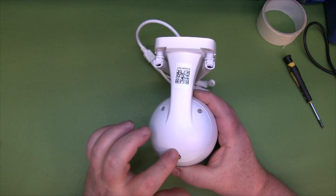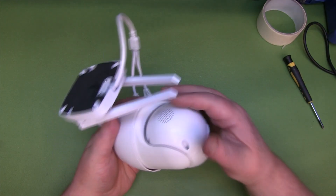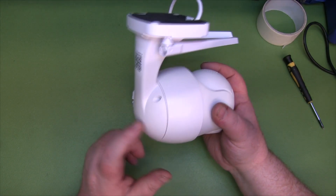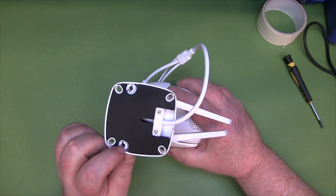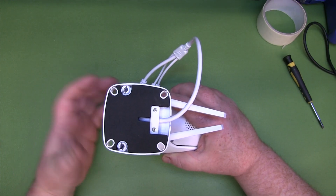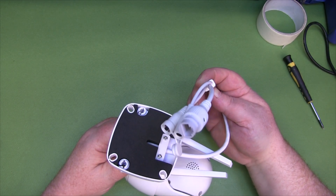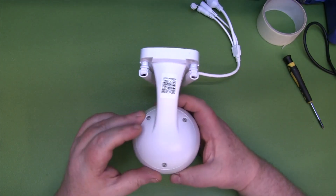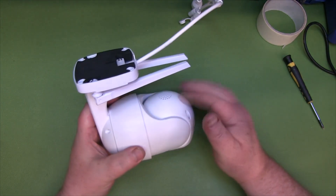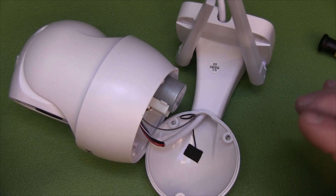The main construction is straightforward — there are three Phillips screws holding the back plate on and four Phillips screws holding the ball of the main camera together. The circuit board will be in the main section; there are probably gears in another part. We've got two antennas with black coax and grey coax going in, which suggests either a HIROSE connection or a soldered connection. There are also outlets for power, reset switch, and ethernet communication. I'm going to remove the three Phillips screws first.